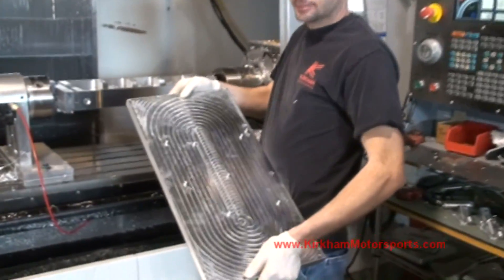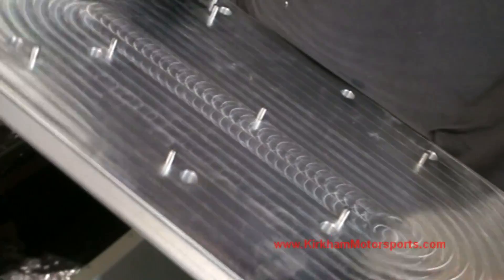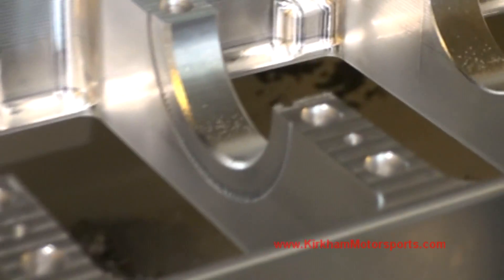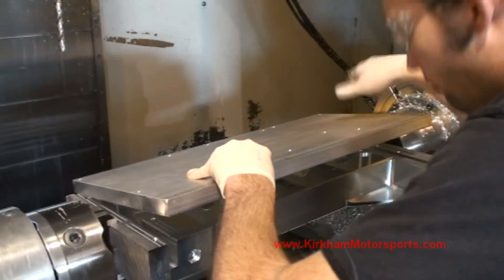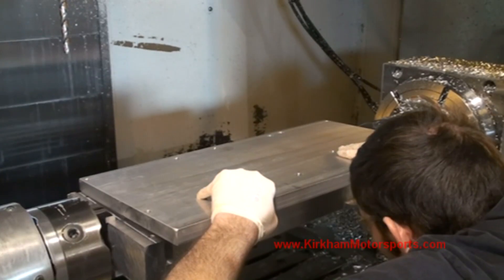Dave made a special fixture plate here with dowel pins. You see the dowel pins? They go into the mains, into the little tiny holes we machined earlier with a 1/8-inch end mill. This will stabilize the part after we cut it free from the block.